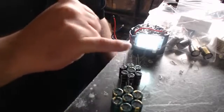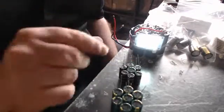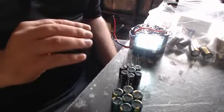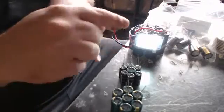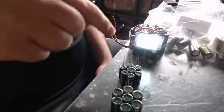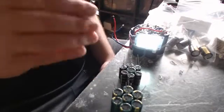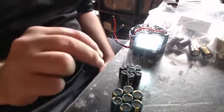Now, in the way that the potentials are, there are 2 wires on each one of them, because of the geometry, there's a certain way you could put the plus on one side or the plus on the other. There's a quantum reality in there of possibilities. Even if it's not plugged right, there's a possibility, if you would plug only one lead to another, of what you can do. Now we know in electronics, if we plug them plus to minus, plus to minus, plus to minus, we have a series connection. We also know if we plug them all minus, minus, minus together, and plus, plus, plus together, we have a parallel connection.